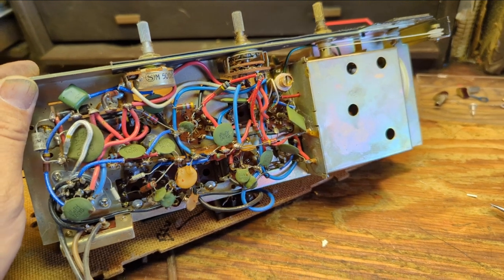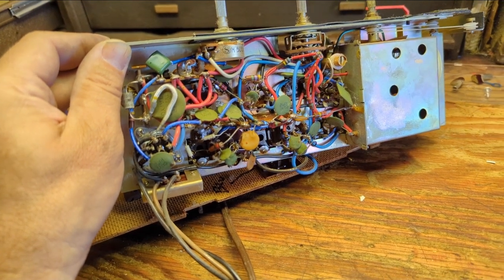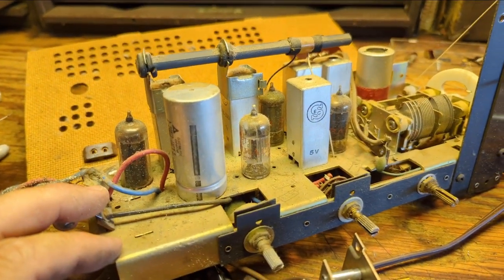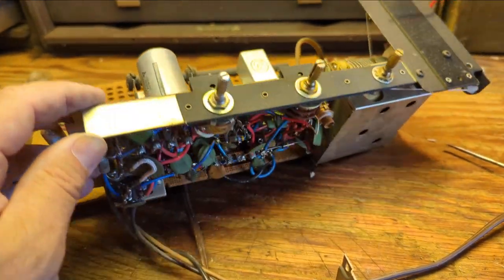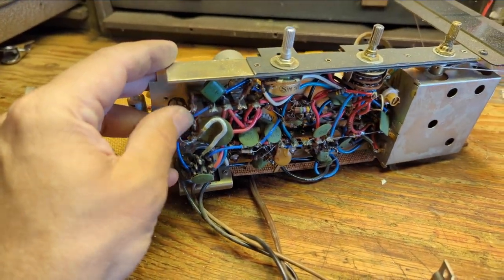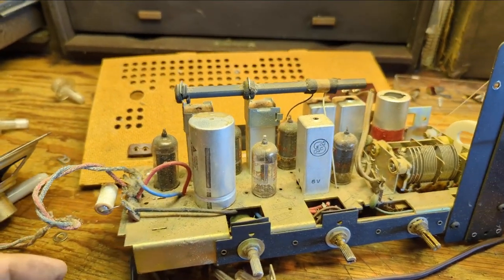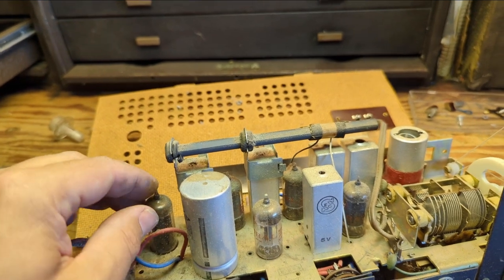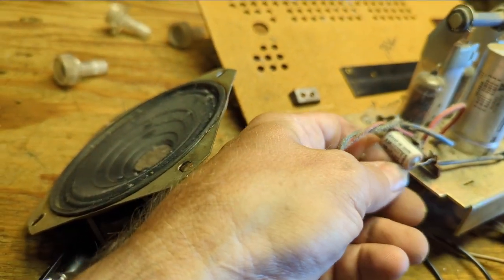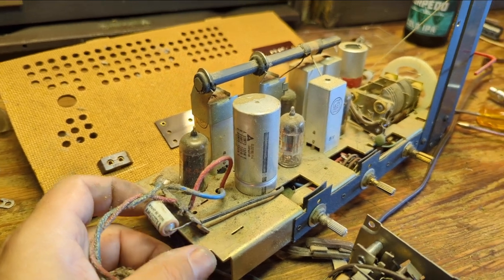Let's look underneath. Wow, there's like nothing to replace — this is all ceramic capacitors. And like I said, usually I find these electrolytics are okay. So I think what I'm going to do is clean the pots and the controls, maybe the tube sockets, fire it up and see how it's going. There's not a single paper cap in this at all. Looks like we've got a solid state diode too — hence why I would have expected more tubes for an AM-FM set. But that's the rectifier, so technically this is a seven tube equivalent set. We have this across-the-line cap, and we're going to put the proper X2/Y2 rated across-the-line cap in.